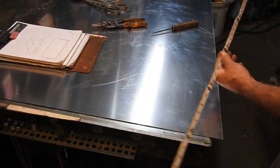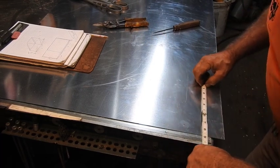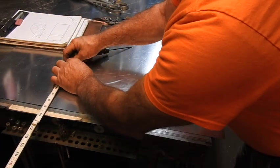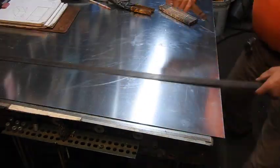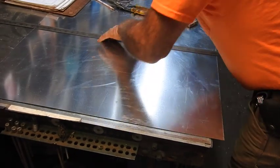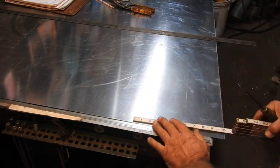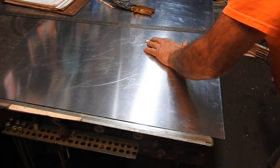So what we're going to do is lay out our height, which is 8½ inches. We're just going to mark 8½ here. Now let's go 17 because we're doing two at the same time — 8½ and 8½ is 17. So 17 from the outside edge. Grab your straight edge. Now we know we're 10½ inches, so we're 10½ inches plus the one, which is going to be 11½ inches. So we'll come in here at 11½ inches and mark it out.